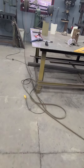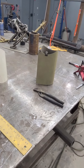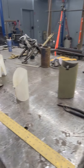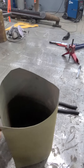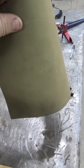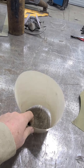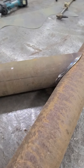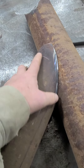You make a pattern. I wanted to show these patterns — I've been messaging with one of my buddies up in Pennsylvania and they've been building some stuff up there. This is a cope pattern for that pipe. This one is old because I made it a long time ago, and it's made out of gasket material — like automotive gasket material for an engine. This pattern here is a 45-degree cope for a fit like this. Once you got one fitting good, you make a pattern you can wrap around that pipe and mark it, then you can make another one really easy.